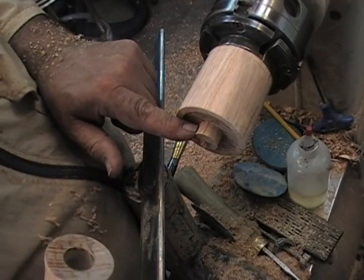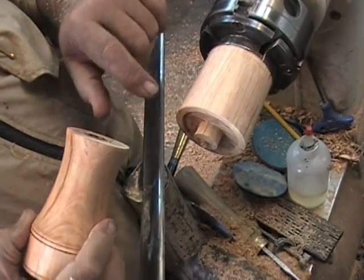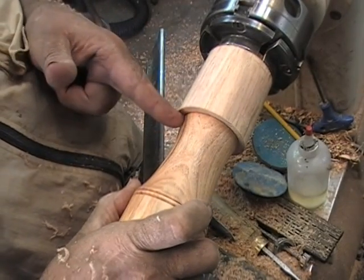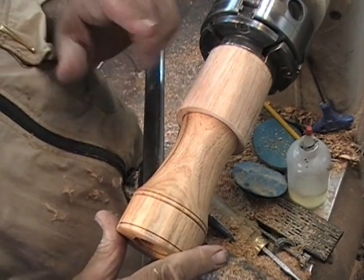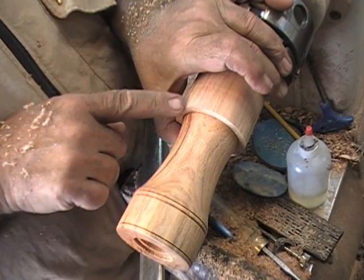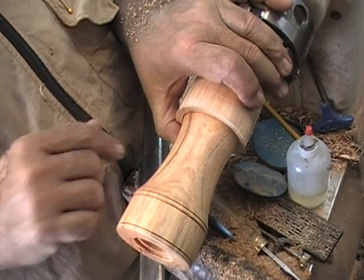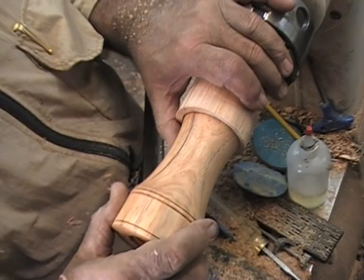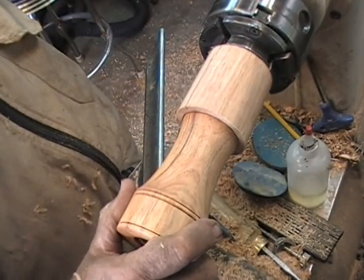This tenon goes in here and makes the piece operate. This notch hides that joint. When you look at the piece sitting on the table, this will be broken only by the grain line, not a black line that goes through it. See what we're doing? Camouflage. That's French for you can't see it. Really.